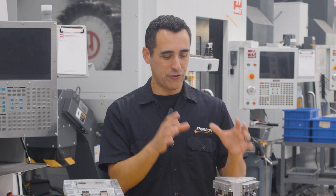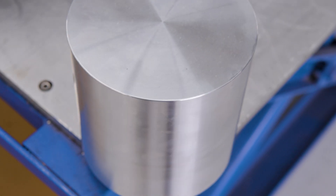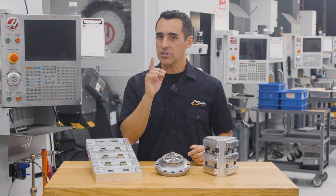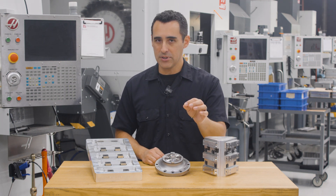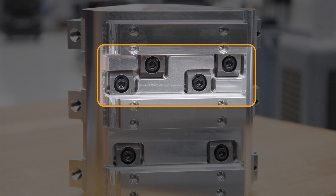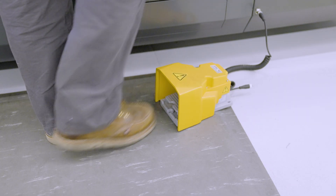We started with one of our off-the-shelf round pallets, which have a 5.9-inch diameter and a 6-inch height. When we laid it out in CAD, these parts were just a little too long for four sides and clearance would have been a little tight. So we took the safe approach of doing three sides per pallet. On the shorter versions of the inlet bridge, we actually do four parts, but we prioritize safety and reliability over capacity. If you notice right here, we actually put these clamps in the same section and did a staggered offset. When we laid it out, we would have run out of space with the typical patterned approach of part, clamp, part, clamp, part, clamp. So sharing a row for clamps is a nice strategy to achieve even higher density of workholding.